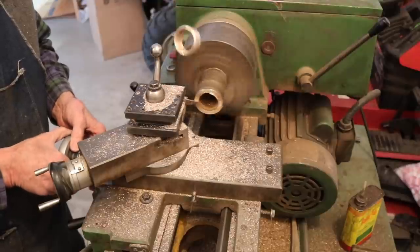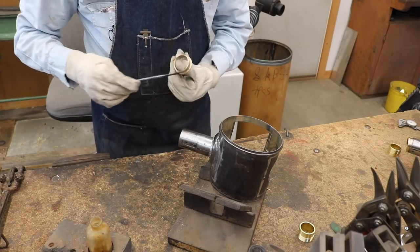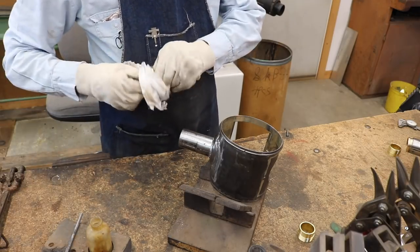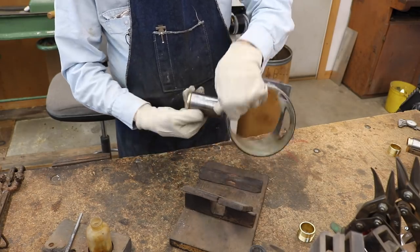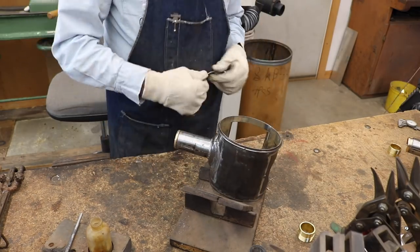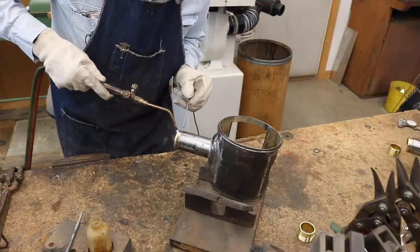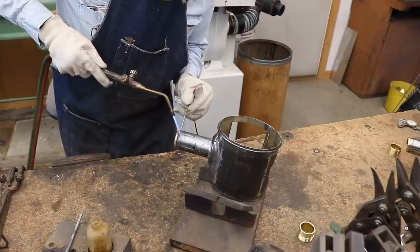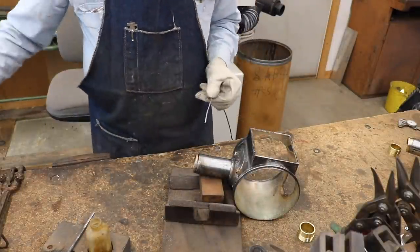I'll solder the newly made collars with the female threads into the upper portion of the tails. The male threads are a size and configuration that I use a lot of, and I usually make a pretty good sized batch of them. So I'll just take them out of stock. You can see a couple of them sitting on the bench here.